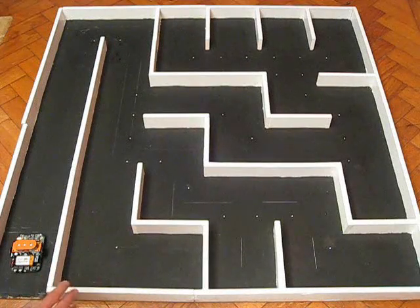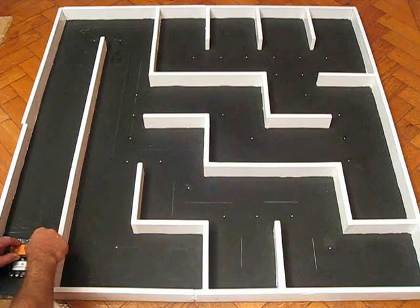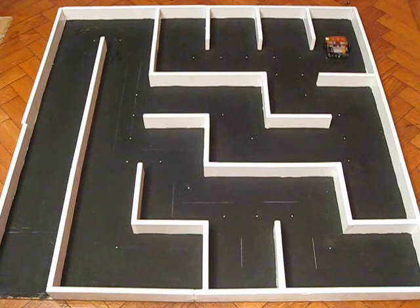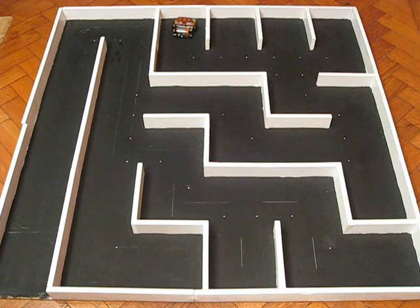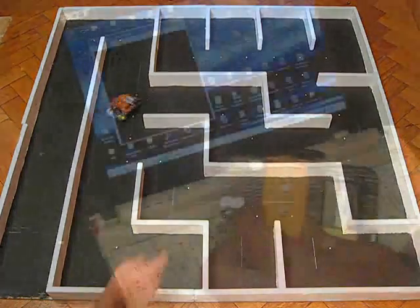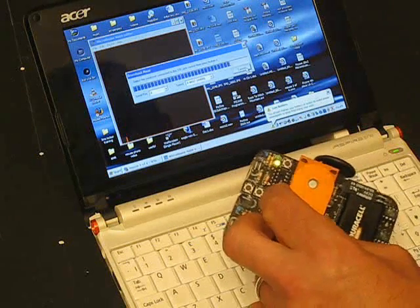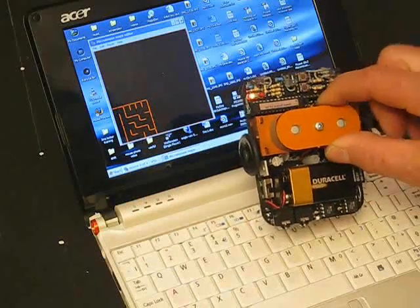This is a refined version of the software that PIC-1 used to achieve 4th place in the 2009 finals, so hopefully this will be running pretty competitively. There is probably some fine tuning still to be done, and different maze surfaces will require different setups. Obviously the turnaround is slightly too far, but we can tweak that. Apart from that it seems to be going quite well. We ran the mouse in the maze and we're just going to extract the maze map from it to make sure it hasn't made any mistakes — just hold button A down. The maze map is exactly identical to the maze. That is a complete full working micro mouse.